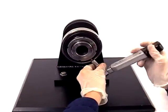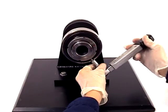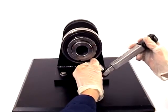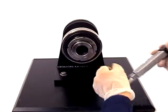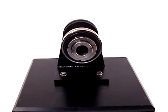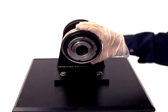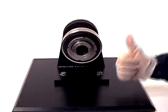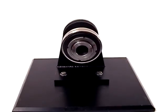Over-tightening or under-tightening the locking screw could result in damage to either the shaft or bearing soon after the machine is put into operation. As a final check, turn the shaft or outer ring by hand. Note that for large bearings this can be quite difficult due to the weight of the bearing or shaft and drag losses resulting from grease and the seal.